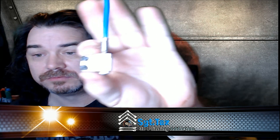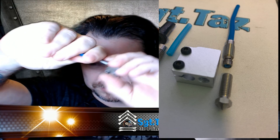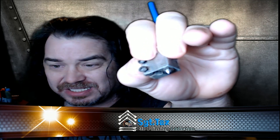Here is your standard Volcano-style hotend. As you can see, the Bowden runs all the way through the heat break. The PTFE tube needs to be cut flush so it sits flat against the nozzle. You want it touching the nozzle and completing the whole setup so it does not have any gaps — no areas where your filament can ooze and pull up and cause you either poor extrusion or the horrible clogs that you get when you don't do it right.